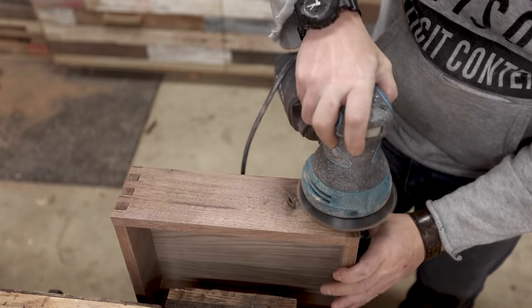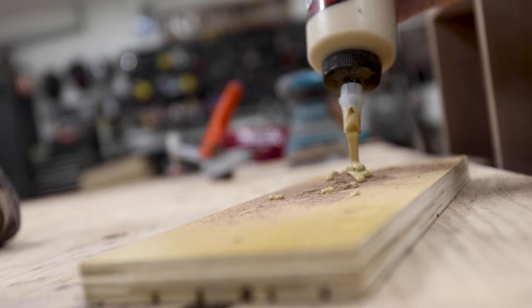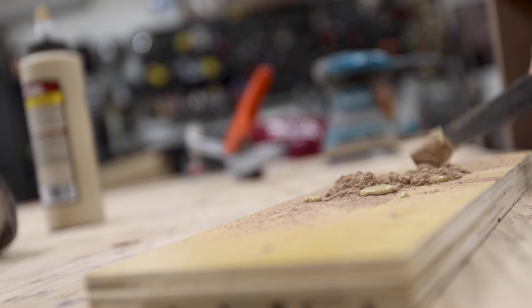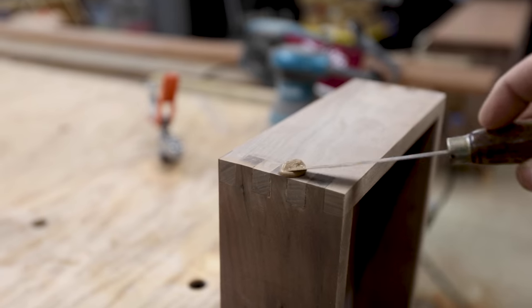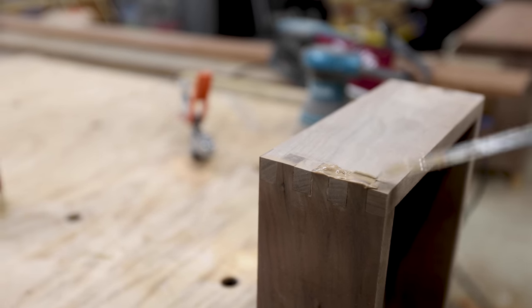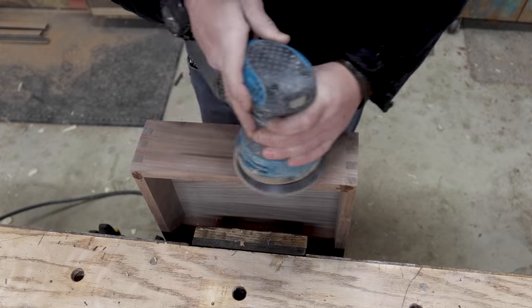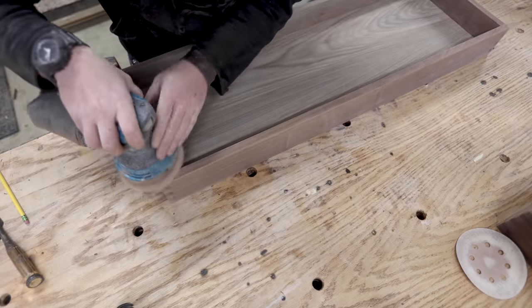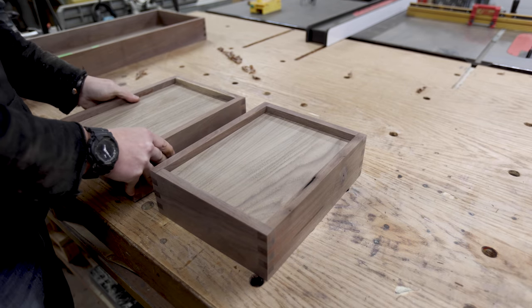After the drawers were glued up, I sanded down the fingers and made a perfect matching wood putty out of some walnut dust from the sander and some dark glue. When it dried, I sanded it all off, revealing those beautiful finger joints. And I know they don't compare to dovetails, but there's something about that end grain sticking up in walnut that just looks so good.